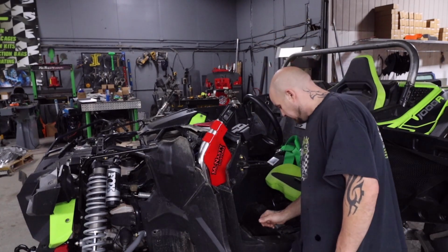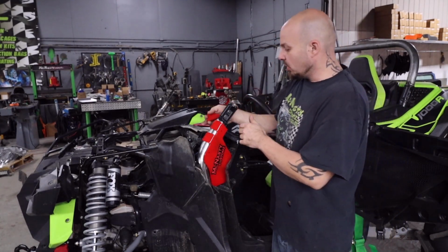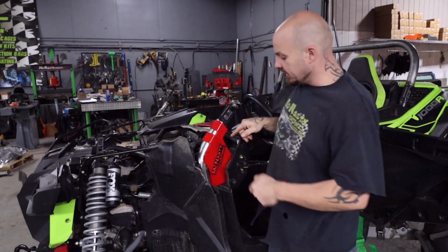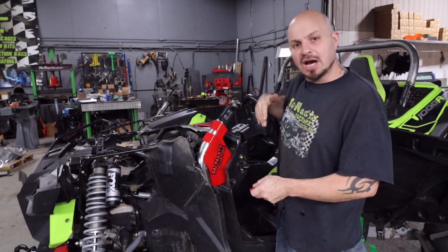There's also the other piece that dropped in here, another 45-degree gusset. It goes in this back corner over here, and you weld that in as well. You can simply slide it in from behind. It connects the very back side of this to that tubing, that 1.5-inch tube that goes across the front. I'll do a close-up of that.